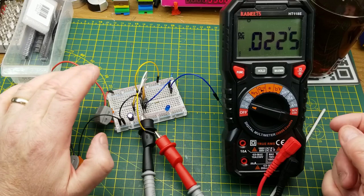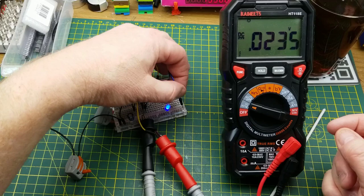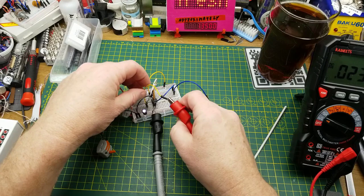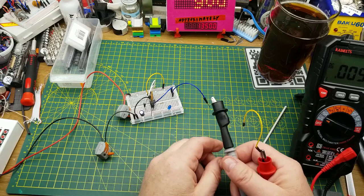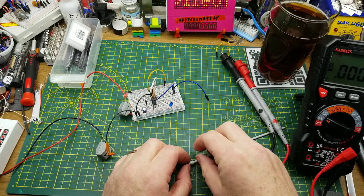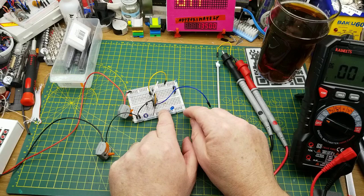Unfortunately, it's hard to show, especially when this thing changes ranges, but there we go, 3.3 volts, which is pretty close to 2/3 VCC. So that guy you could use to trigger basically anything. You can have a relay kick in for X number of seconds, obviously just adjusting either that resistor or that capacitor or both is going to change how many seconds. And there is, of course, some math in the datasheet to show how to do that.